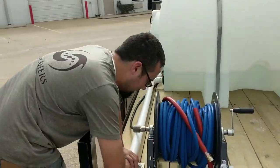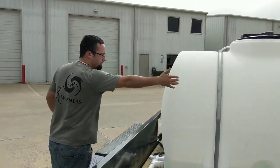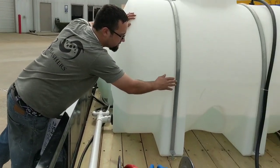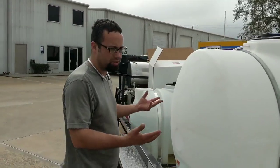This is going to be the dump valve to get rid of your water. That's going to be in this 525-gallon water tank. We use galvanized straps — these are a lot more sturdy, they're a little bit more expensive, but this tank is not going anywhere with these galvanized straps. Galvanized is also more resistant to bleach than using a carbon steel strap.